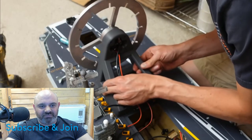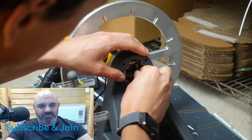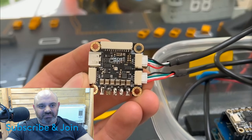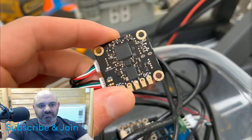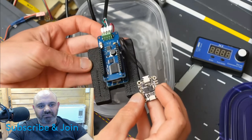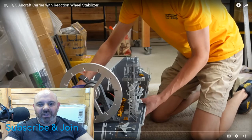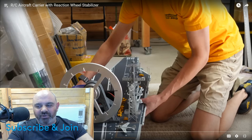This is a reaction wheel that I glued to the deck. The reaction wheel is directly coupled to a big brushless motor, which is controlled by the new ODrive Micro. It has a hall effect encoder on the back which can measure the motor's exact position and speed. This way it can precisely control the acceleration of the flywheel, and when paired with an Arduino and a gyro, it can actually stabilize the boat.